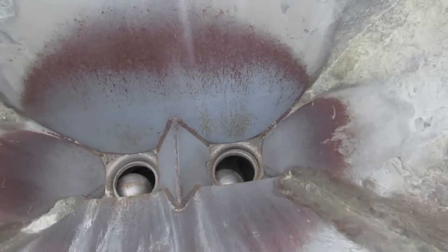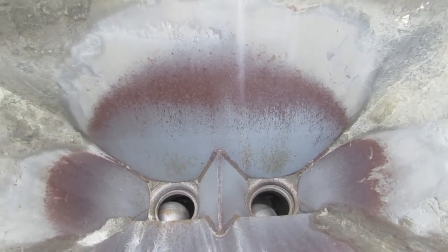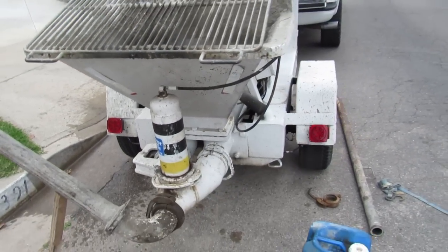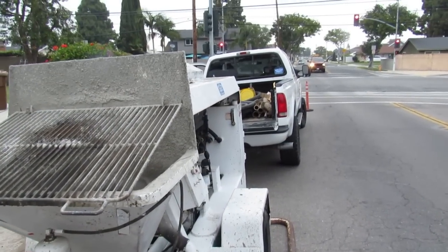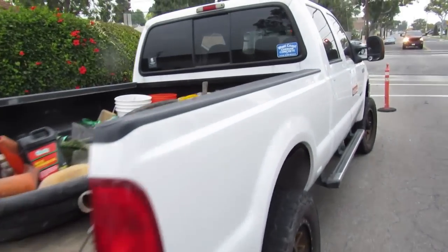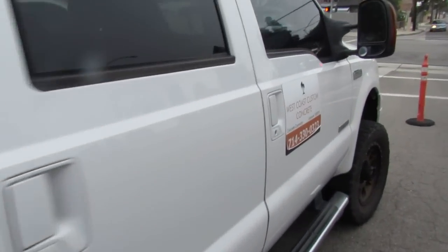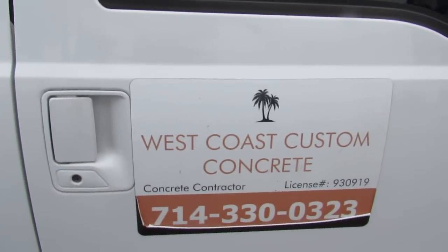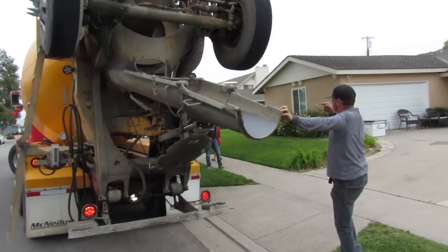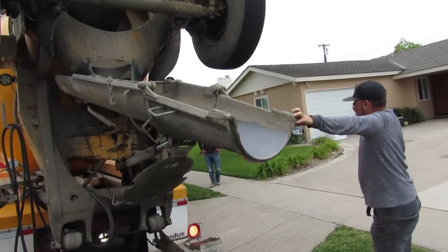There's a hopper there. It's a ball valve. There's 2 discharge balls, and then there's 2 in the back intake balls. So there's 4 that go up and down simultaneously in opposite ways as it sucks into the cylinder and it pumps. And then you have a surge tank with nitrogen to keep the line from surging on you. So it just lays there. It doesn't move. It doesn't, like a swing tube, pull you back and forth. There's no reason to use 3/4 rock.